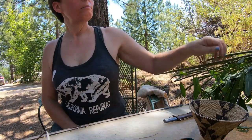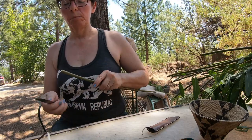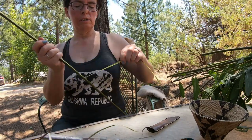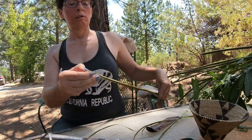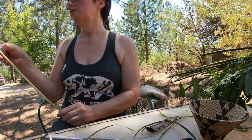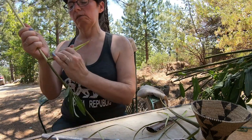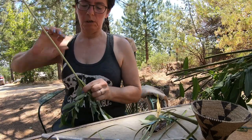Let's get to stripping. I've just sharpened my usual knife. The first thing I need to do before splitting this branch smaller is just peel the bark off. It's fighting me just a little bit, but mostly coming off pretty well — the water is still up in the branch. You can grab the end and pull and most of it will come. Start at the growing end working your way up toward the leafy end, stripping as much as you can with your hands, because it will save you so much time and save your knife from dulling.